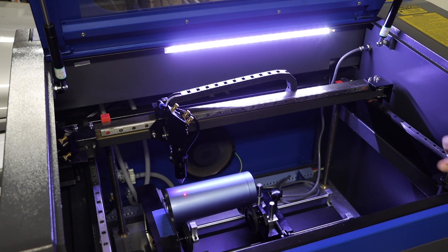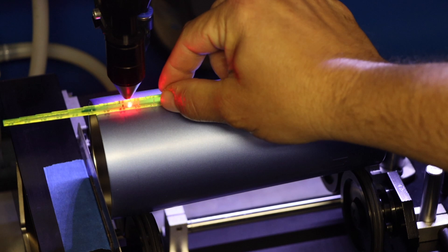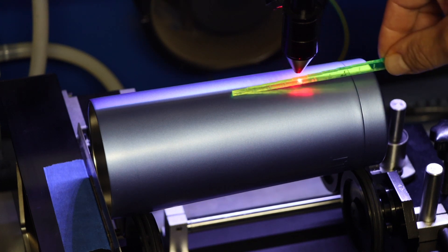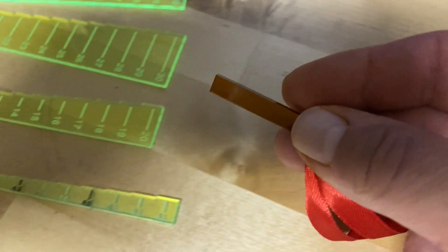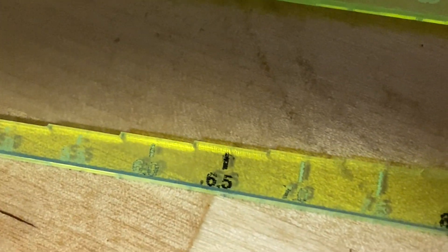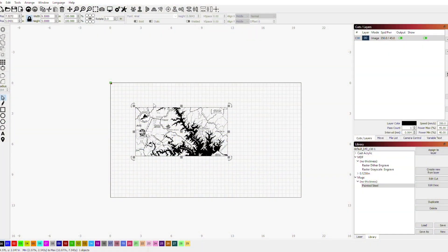Once it's complete, you can manually move the original Y-axis to make sure your laser is in the center of the object you're working with. Since the axis is no longer powered, there's no resistance. I will adjust the bed up and then measure the focal length on the left side of the cup. I'll then move the laser to the right and re-measure, and for that right side I'll simply adjust the rotary level until both sides are correct. That key I'm using is custom — my little import came with a piece of acrylic to set the focal length at about 8 millimeters, but I cut and etched some custom depth gauges to test and it turns out my focal length is more precisely 6.5 millimeters. These edges on the key also help to feel the nozzle and make setting this easier.